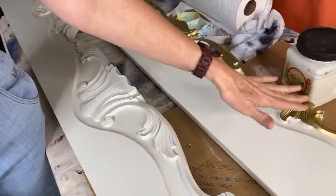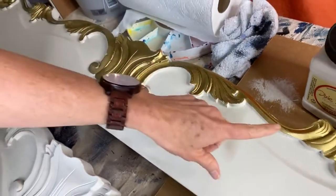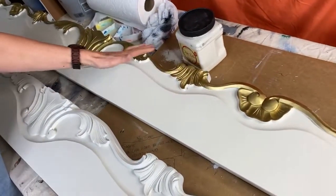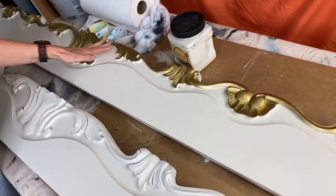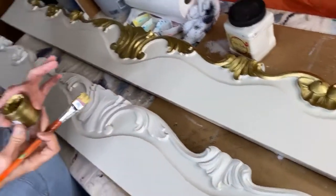It is water-based and it's thick, but if you put this on and then do what we normally do - come out the next morning wanting to put your top coat on - the gold areas like these side rails I'm working on, this gorgeous gaudy sheen is all this gold mousse. You can't do this with the wax - wax doesn't spread this well. This gives you great opaque one-coat coverage. But that's not cured - it might be dry to touch by tomorrow morning, but it's not going to be cured. It doesn't require a top coat; it will cure on its own.